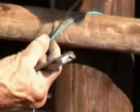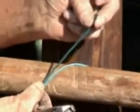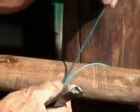The Cortool also provides a great solution for fastening one pole at right angles to another. Begin with a piece of string for quick measurement of the material. Measure once diagonally around both poles. Include an extra length of approximately 160 millimeters for fastening it. The wire is bent according to the measured length on the string, and when bent over, it is cut off.